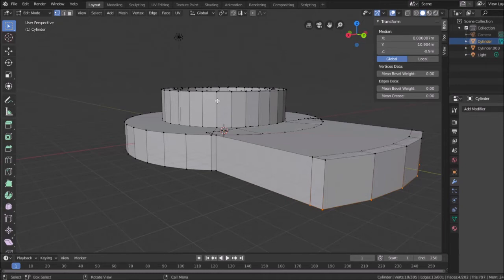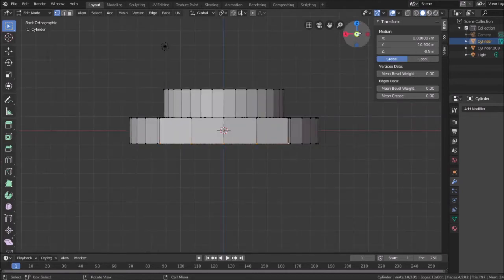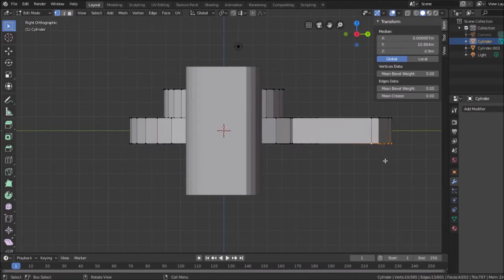So the same height I had, oh, what was that? Sweep tab width is 1.5 millimeters, sweep pad 7.6, shaft bevel, shaft diameter, support pin diameter. I don't think I measured that. Or at least if I measured it, I didn't write it down, so I will measure it. .5 millimeters. So with this, we'll look at the X direction there, so we see our tab. Now I'm going to just extrude this.